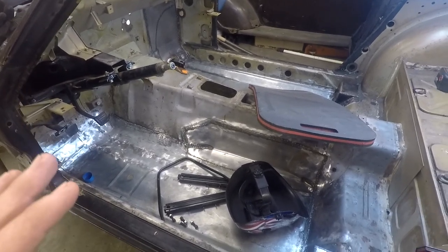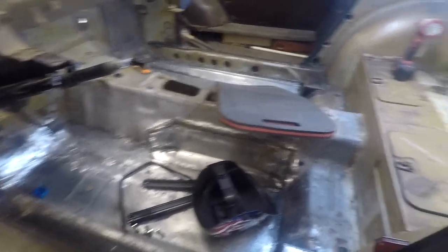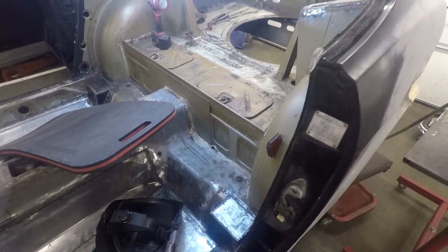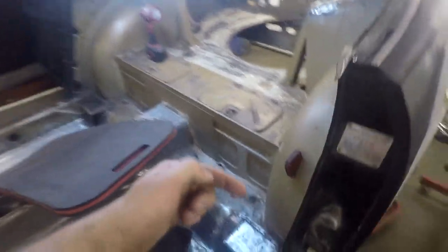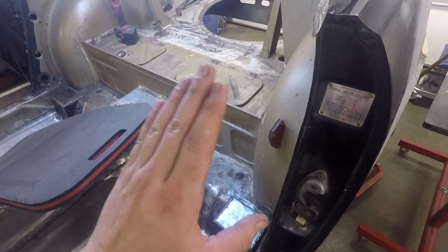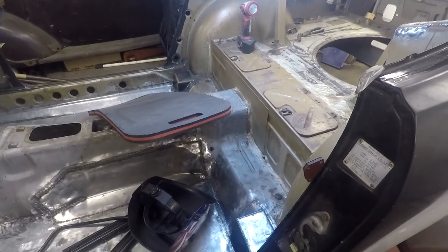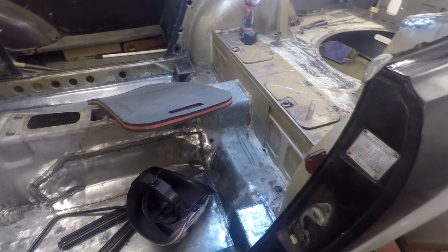And I want to get it in there so I can basically get my seat bolted down where I need it. So then I can build the roll cage where my seat is going to go, because you can angle the hoop back some, or you can scoot the bottom of it up forward on the plates, or you could move it back, which is going to be straighter. So there is quite a bit of adjustability I can do with the main hoop. And I just want to have the seat in there so I can see where it best fits for me.